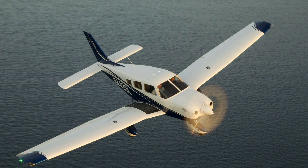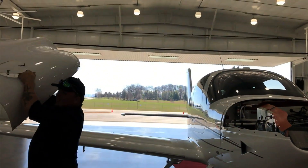The time before overhaul on this engine is 2,200 hours. One thing that's nice is that if it's a high-time use engine, that TBO gets bumped up to 2,400 hours — so if the airplane is flying more than 40 hours a month, the TBO is actually 2,400 hours.